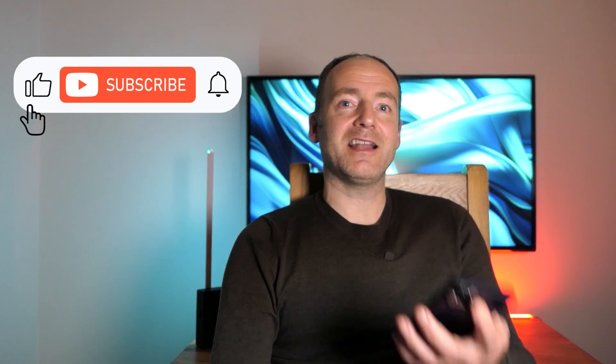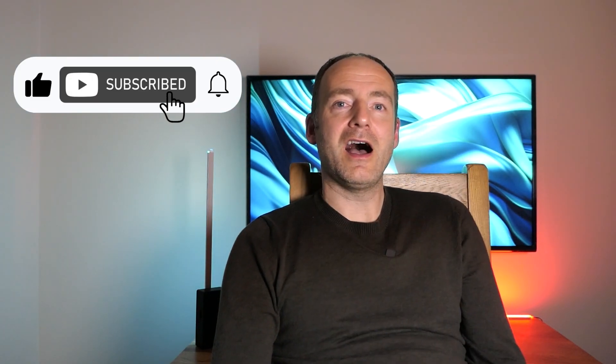In the next video I'm going to show you how to build the key light - the one that's illuminating my face right now. I'm using a warm LED and a cold LED, using pulse width modulation to control the color temperature, again controlled by WLED. With that light we can go from a really warm yellow to a really cold, almost clinical white. I'll show you how to make that - all on WLED - and I'll see you in the next video.